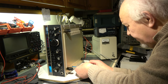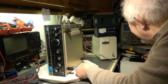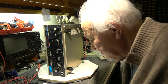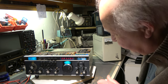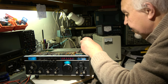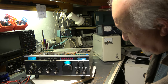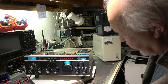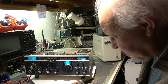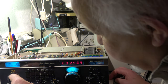This pot is dirty. Not more than 140 Watt. On 28 MHz we have to key the transceiver again and set this pot on the pre-driver board for 100 Watt output until the ALC is lit, but this is not possible. We do not get enough output power. We have 100 Watt but the ALC is not reacting. We have seen that we cannot get the full output power of 100 Watt at the higher bands on 21 and 28 MHz.